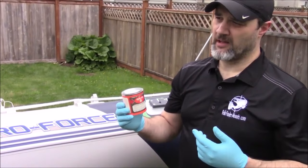Okay, so we're going to do the mixing of the glue again, so you guys are very clear on how that all works. We're going to pour some of this in there. Probably don't need that much anymore, just the hardener, actually. It's 100 parts to 12 parts of this. I think I'll put some more glue in there just to make sure the mixture is not overly hardened.